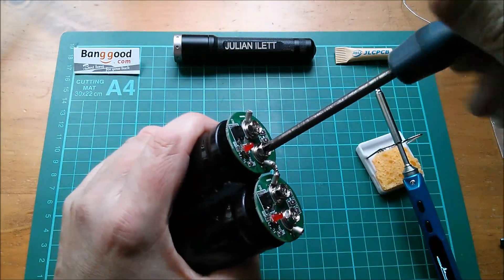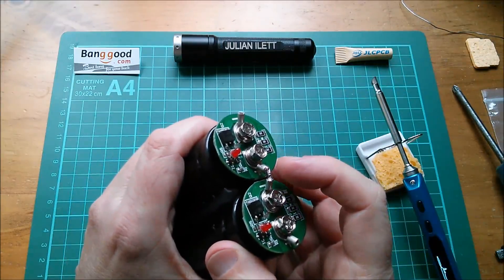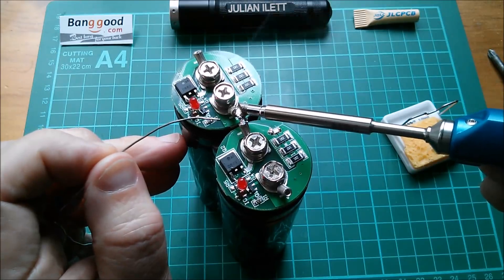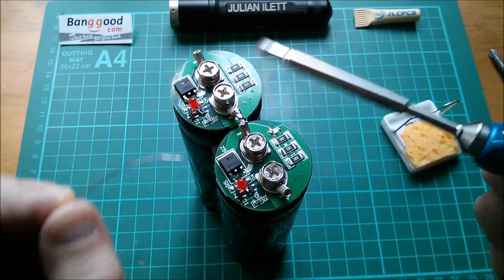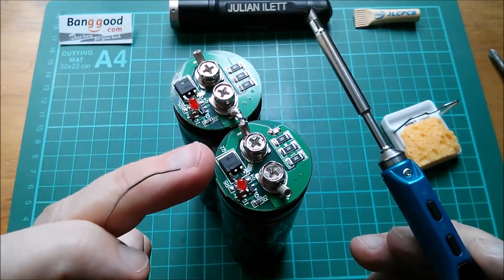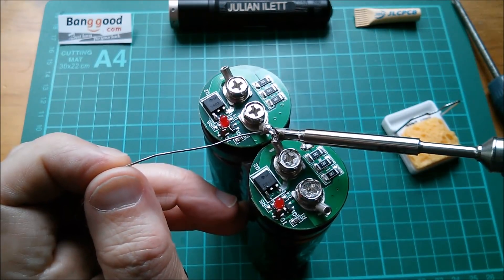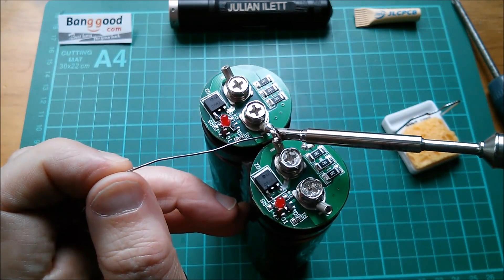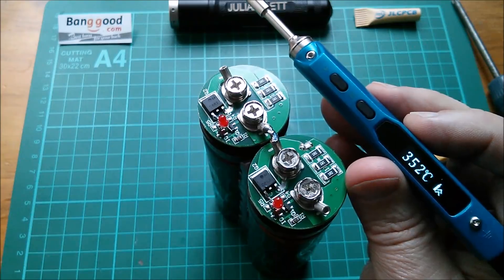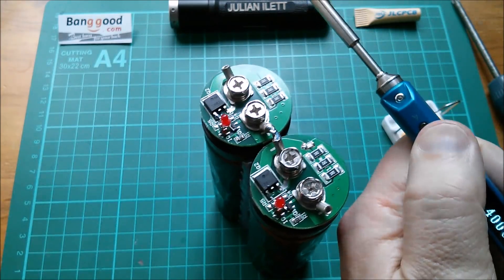One thing I thought might help: if I undo one of the bolts there's much less thermal connection between the fork and the bolt. The only problem is the fork is now free to wander about — oh yes, that's melting very easily! That's melted incredibly simply. That's done one side, so if I tighten that one up and undo the other side I can probably get the other side done as well. Yes, that's working fine — that has completely melted. The fork terminal was wobbling about while melted, and this did drop in temperature, but I've made my solder joint.